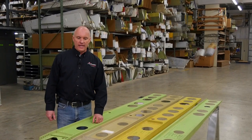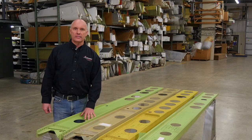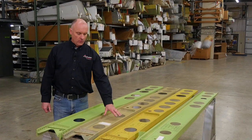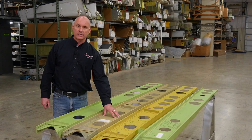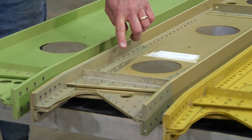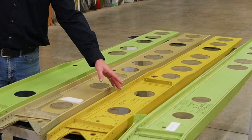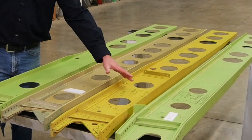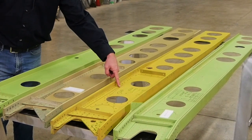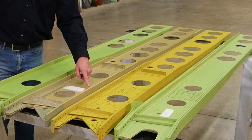With the inboard spars laid flat, it is evident to see the differences in the designs. Starting closest with the PA-28 spar, we have just the basic spar only. Going over to the 236, you can see the same basic I-beam extruded spar with additional angles installed and additional plates in the web. The 1979 Cherokee 6 — the same as the Lance — also has the same basic I-beam spar with additional angles and plate installed, and you can see that the Cherokee 6 plate is larger than the 236 plate.